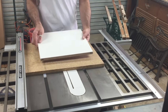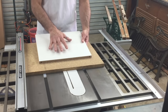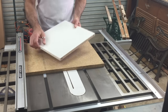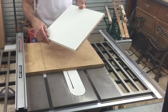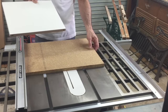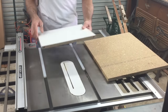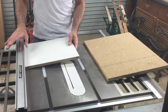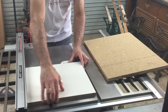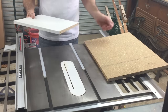The backing board is going to be this piece of melamine — a leftover shelf from my wall unit. Some of you would have seen me using this when I made the mortising jig for the router. These edges on this board are the factory edges, so I measured them and found which one was a perfect square. I verified that by putting it up against an edge I know is straight, marking a line on the table, then flipping it over and lining it up with that line — it lines up perfectly. So I know that corner there is square.